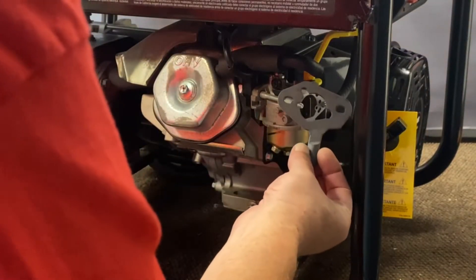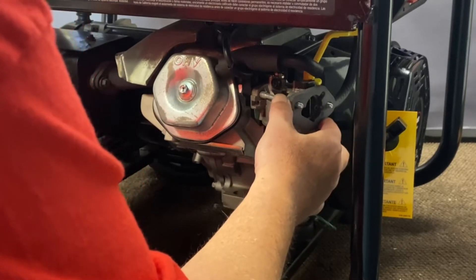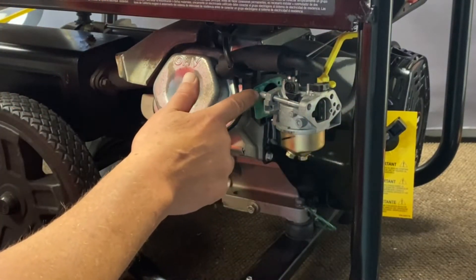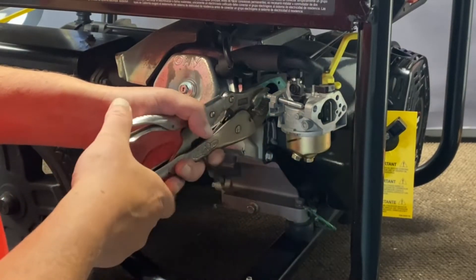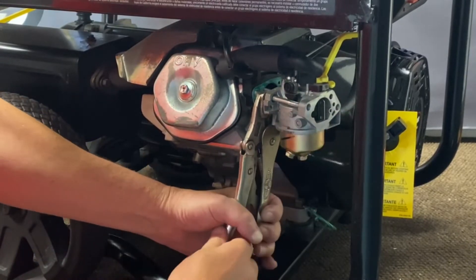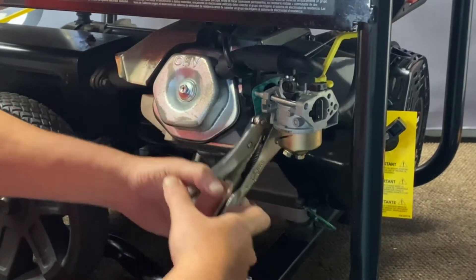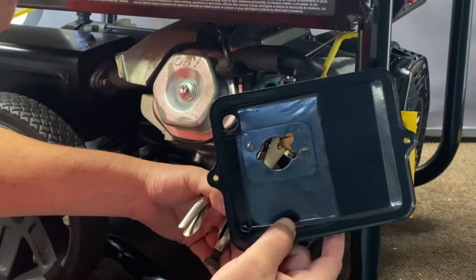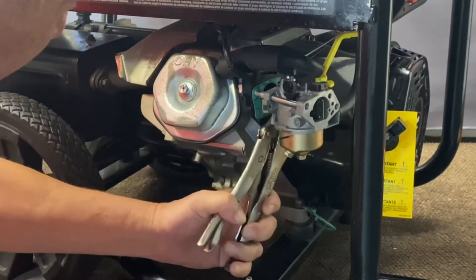When we install our slim adapter on here, we're pulling this out a little bit. You have the thickness of this which is just a little under a quarter of an inch. What we have to do is back these studs out. Pull the gasket out a little bit, expose the back of the studs, and grab on this thicker portion here. When you grab on this lock down, watch you don't tear this gasket up back there. Lock down on it pretty good, and then don't just try to turn it — pop it, and it'll pop right loose for you. Go ahead and back those out.